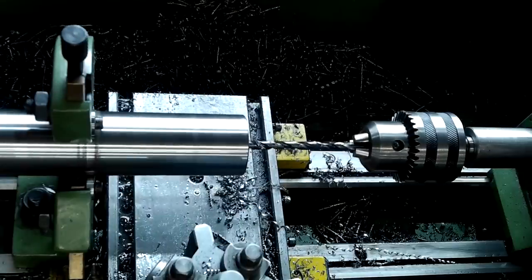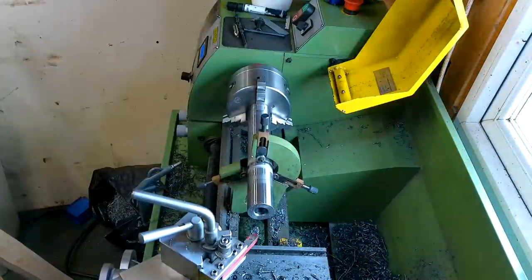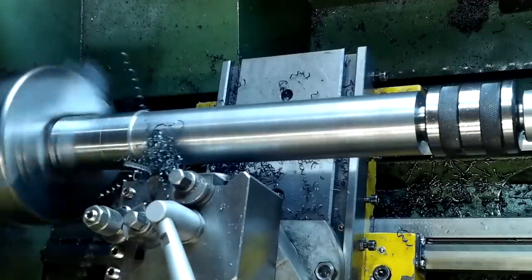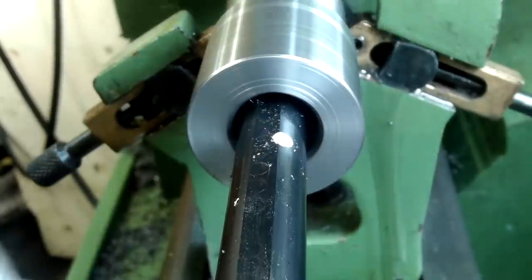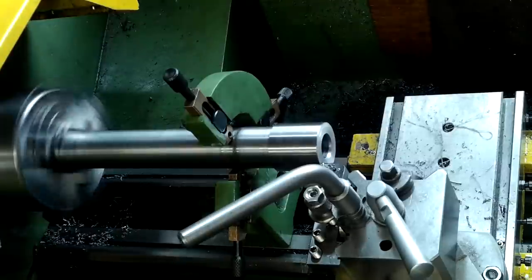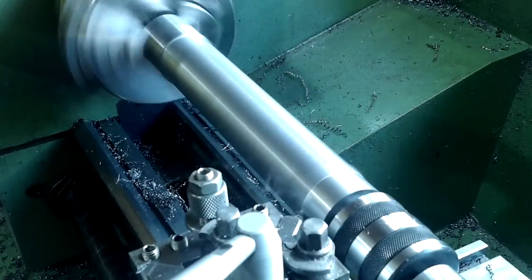Making and finishing the advance tube or the drill spindle in one go was going to be tricky, so they were both first roughed out and then finish machined in a particular order. I started with the spindle first by roughing it out all over. Then after roughing out the collet opening, the main part of the spindle was finish machined to achieve a parallel finish.